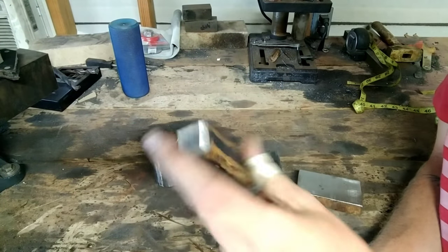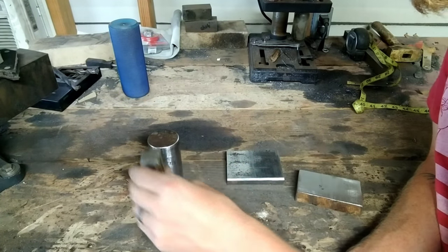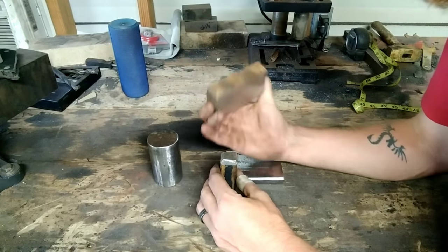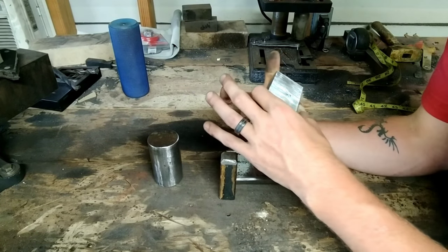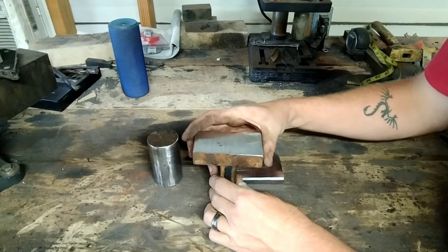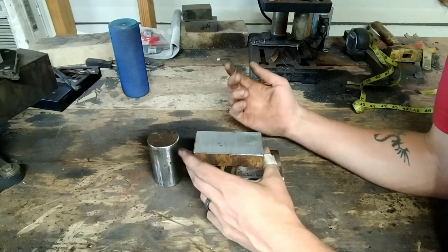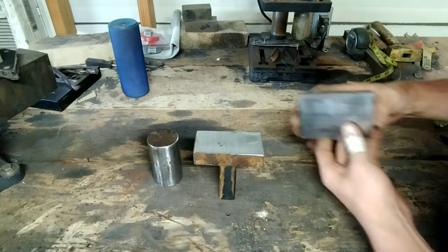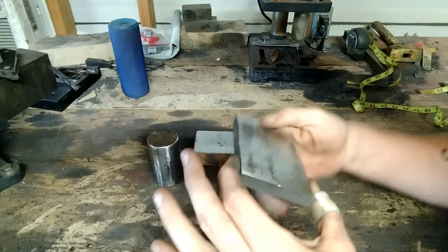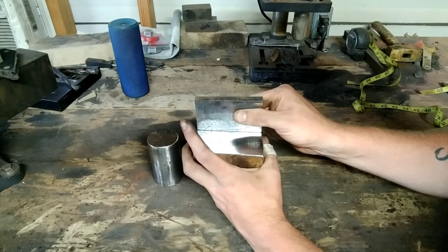What I need to make this: I've got some one-inch solid — three and a half inches of that, chamfered the ends — that's going to be the hardy shank. This is the plate, just some one-inch by two mild steel, structural plain mild, a nice heavy base for it. That's going to sit on there like that. This is just half by three, four inches of it, because that's the length to match the block.